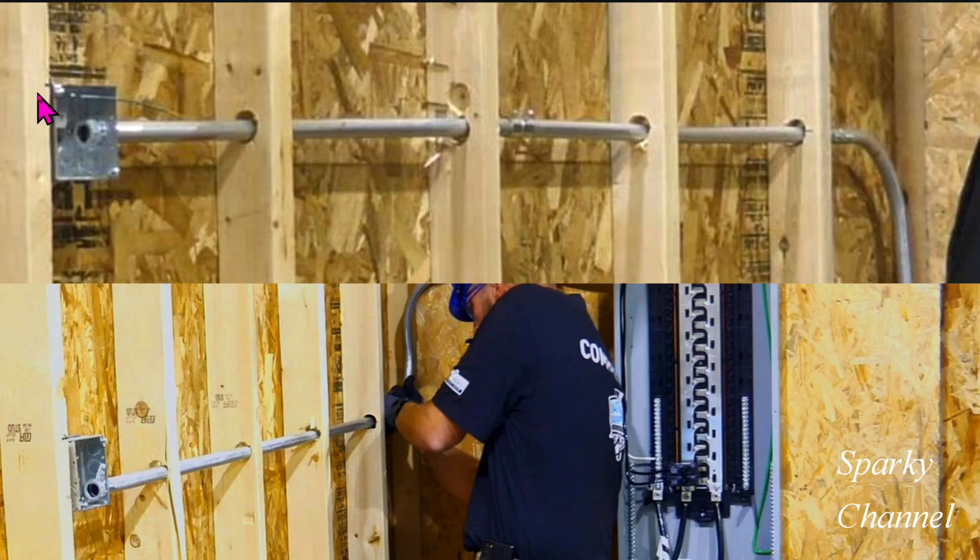For my opinion, I am happy to see that these holes are right in the middle of the studs — that makes the studs stronger and they do their job of holding up the roof and ceiling. As for this one right here, I think it's fine per the code. But this stud right here is split, so I don't think I would pass it as an inspector. I would ask that this be repaired or replaced because it's not doing its job strength-wise of holding up the ceiling and roof.